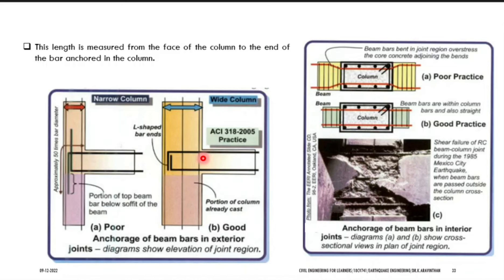When studying diploma, the class text notes had all rods bent in U hook only. If you are placing a ship without placing any anchor, due to tide or wave the boat can go in any direction. Like that the beam also has to get anchorage — it should have an anchor. This is called anchorage or bond of a beam. You can see this kind of failure: at the beam column joint the concrete fails, is disrupted, and cracks occur at this point, due to anchorage deficiency.